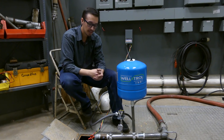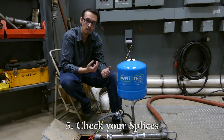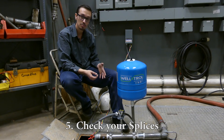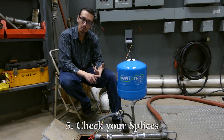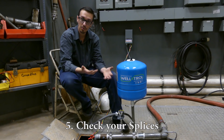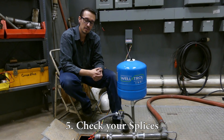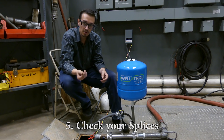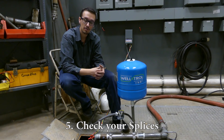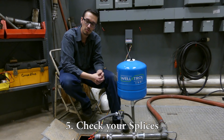When checking voltage, you may have to branch out from the control box and go to where the wiring connections are made. Generally there's a wiring connection from the pump motor to the submersible pump cable, and then from the submersible pump cable to either a UF direct-bury or THHN wire, depending on whether you're running conduit. You have to be aware of all those splice connections and possibly check them, because if a splice isn't done properly, it could become corroded, fill with water, and cause the system to trip or short out.